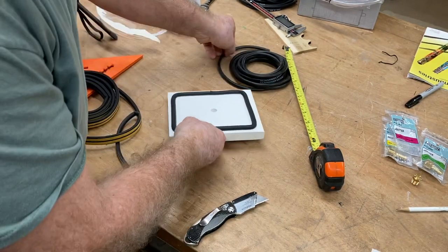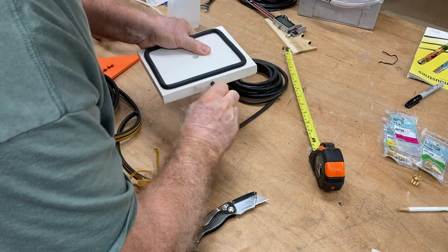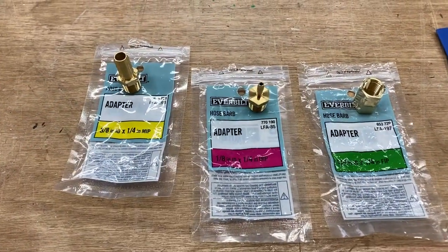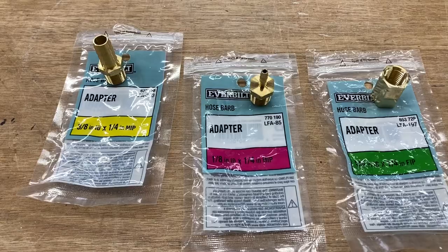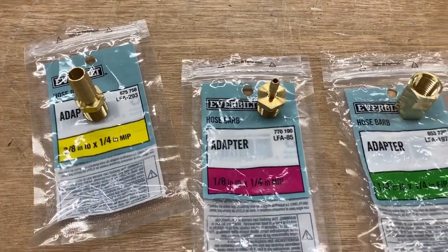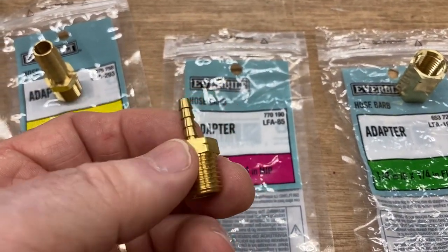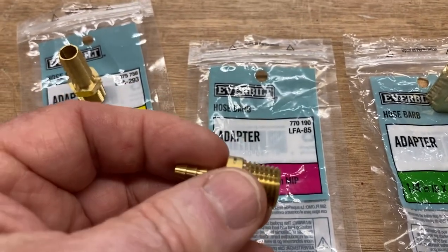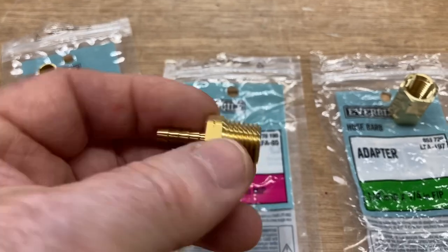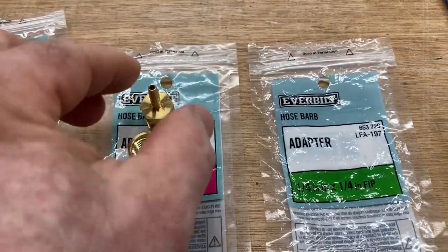Let me grab the hose. I want to plug it in and see if that will go in deep enough where it will stay. That looks like that's going to work well — it's tight and it's not going to just pull out. At the hardware store, I picked up three different types of connectors that I'm going to need to make this work. This one will slide into the hose that is from the vacuum pump itself. And then this one is the eighth inch barb that will slip into my irrigation line. They had this as the MIP and did not have it available in the FIP, which is the female iron pipe threads. So I had to pick up the adapter to be able to put it together.